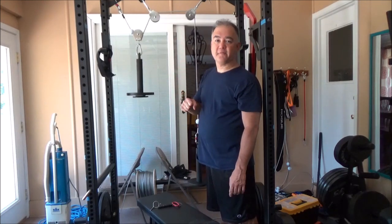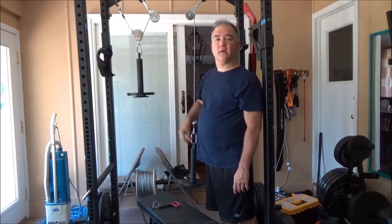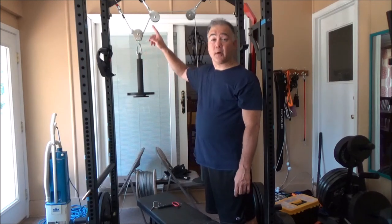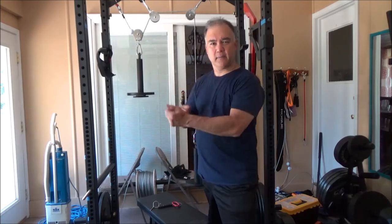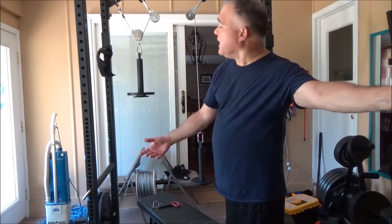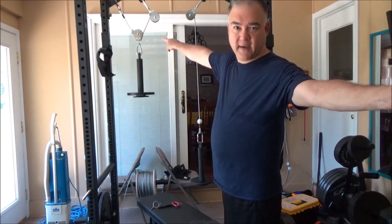Long explanation, but letting you know exactly why. Don't worry — if you redirect force a bazillion times, you're fine, you're just redirecting force. However much weight you have on here is how much weight you're lifting, until you put a pulley on the load. If you put a pulley on the load, you reduce the amount of force required to move the load by half. You can add more pulleys onto the load and keep looping it around — that's called a block and tackle system. It's how old sailing ships allowed sailors to pull up really heavy sails, and probably how they built the pyramids.